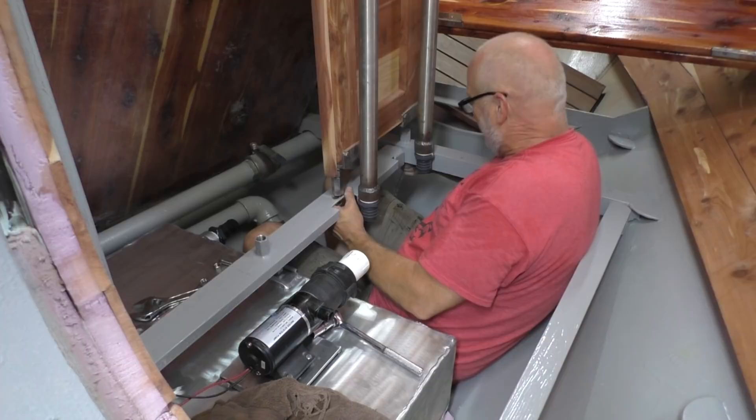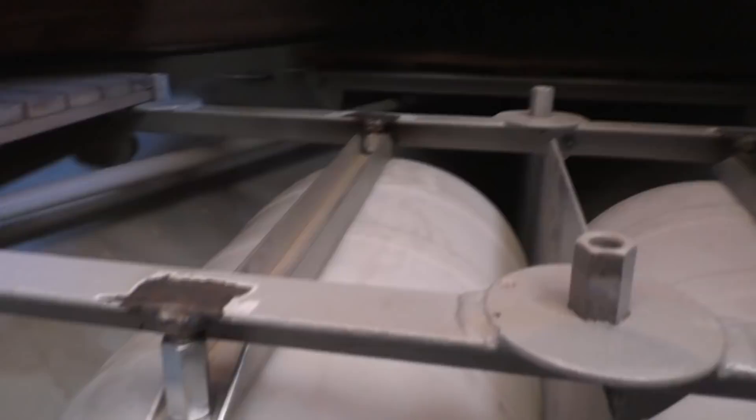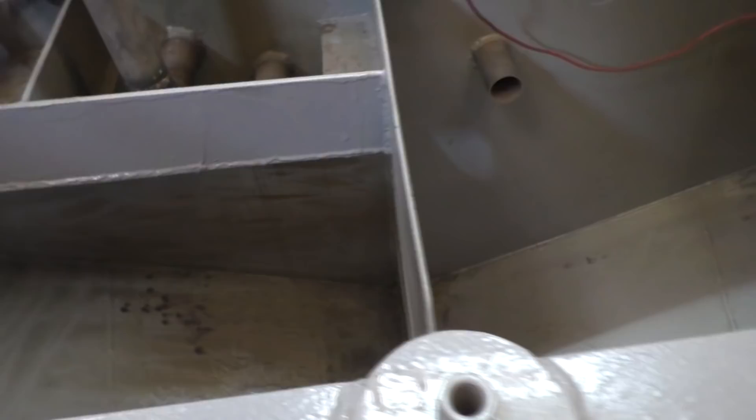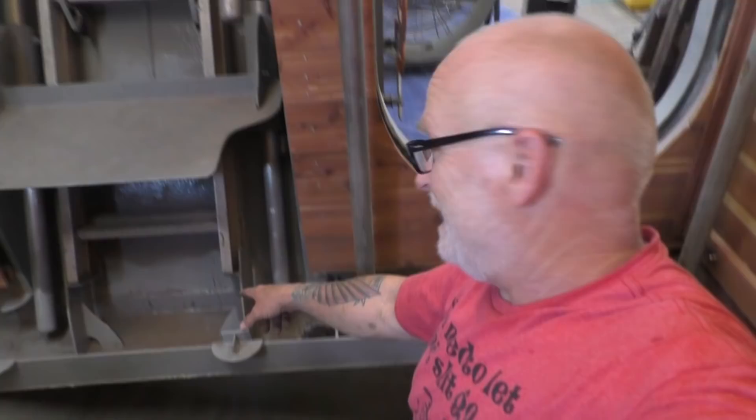These are pretty much the same routine as the aft cabin — you just screw the nut out and it presses down on the bar and pushes the tank into the floor. That foam's going to crush once this has some weight in it, but it's not a big deal to just come in and tighten these up if they get a little loose. I raised my tank a little bit, but I think I'll get my plasma torch out and cut a limber hole down there in the corner — just a hole that lets the water flow from one side to the other so we can get by with one bilge pump in here. The idea is to get this pan at the bottom of the companionway to drain into a bilge tank along with the shower and the sink, with a big pump in there that pulls it out.